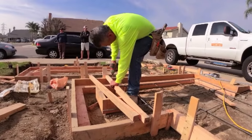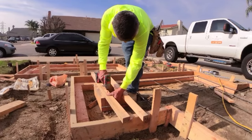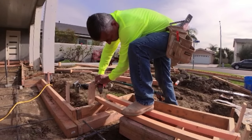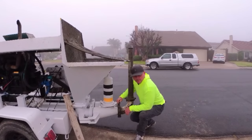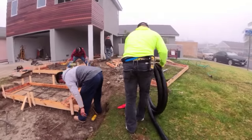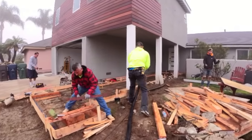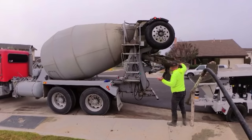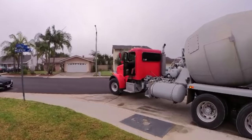That's going to be the planter box in two of the steps. He's going to put some cool little tea trees in them — kind of like a palm with a red top. We put handles on boards across the planter and then put foam around it. We oiled the foam so when we stripped it we just pulled the planter straight up and out, and it came right out. I'd never done it that way, and neither had Javier or Milton, but Milton came up with it.